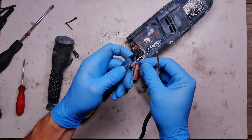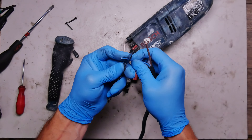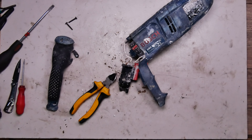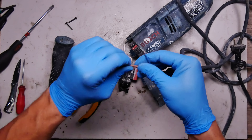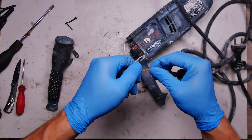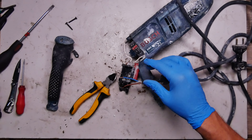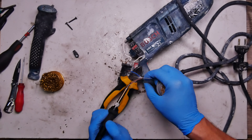I need to repair the ends to something similar like this one. Now we need to clean the ends of the wires. Since we don't have the pressable crimp tubes like the original, I will use my iron and put some solder on these to make them solid.